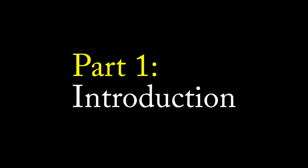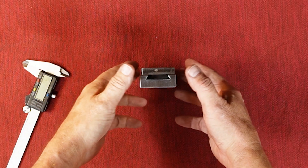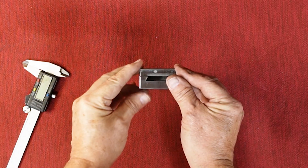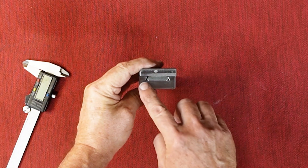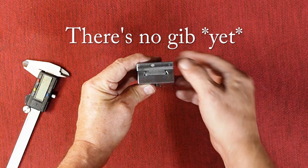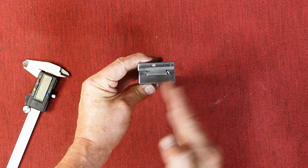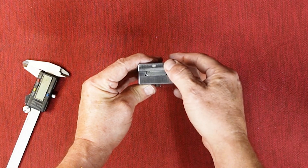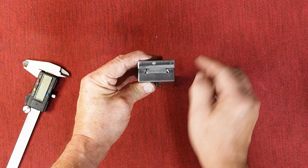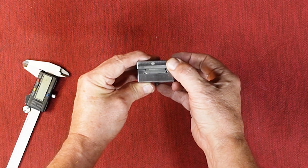Hey folks, it's Greg. Welcome back. I work on a bunch of small projects in parallel here, and this is one of them. I'm not even going to reveal what it is yet, but it involves a dovetail, and it's supposed to be a nice fit in this dovetail. There's no gib. Unfortunately, as I was doing the math to adjust for the tool diameter to subtract on the DRO settings here, I missed a digit and ended up being 10 thou off on each side, so I got 20 thou of slop side to side.